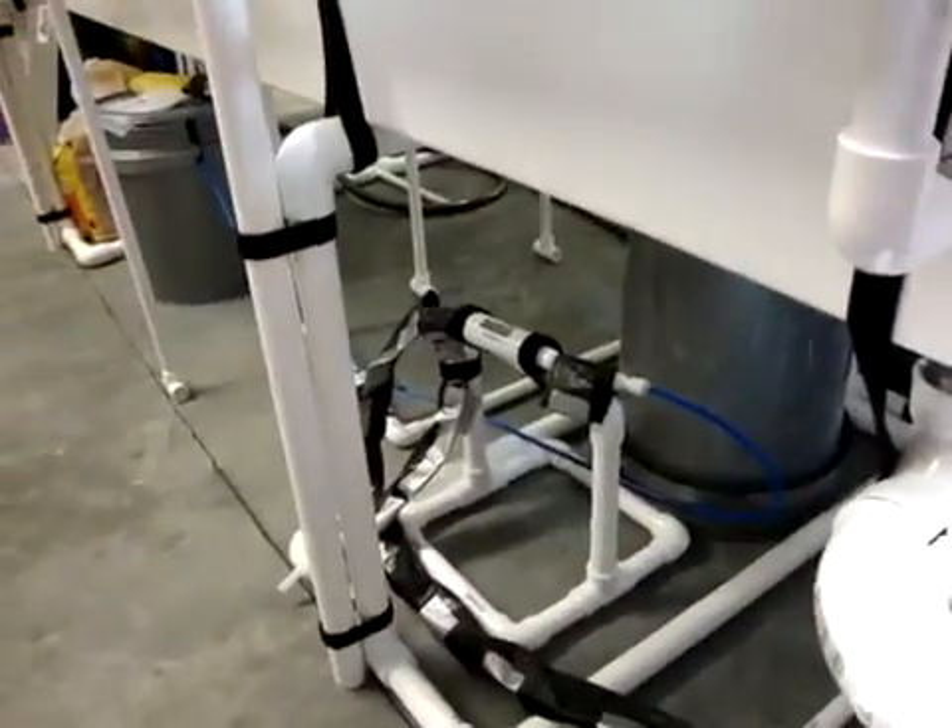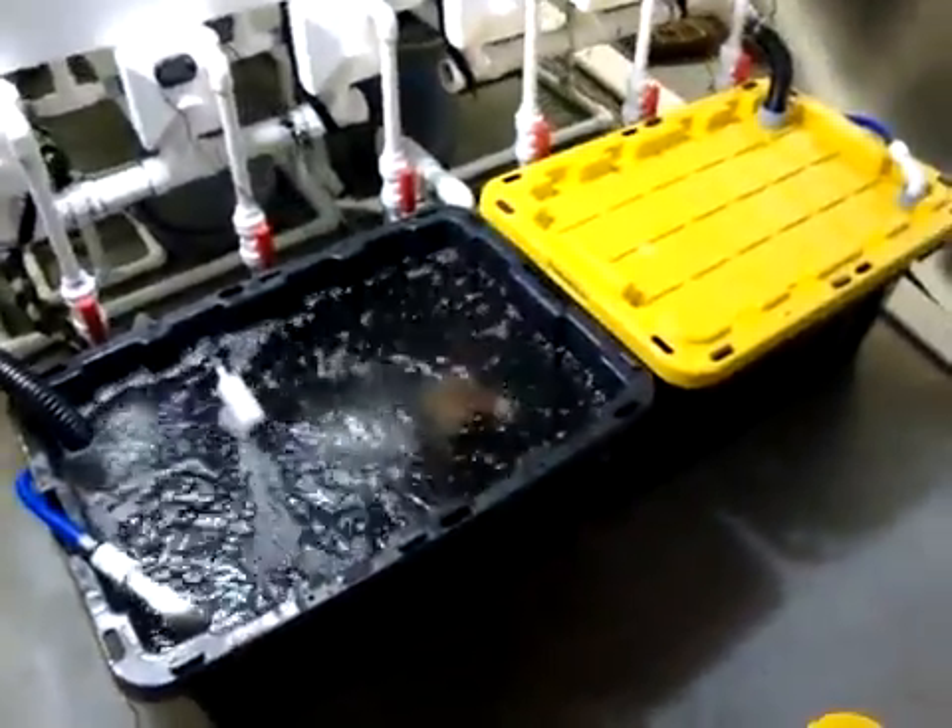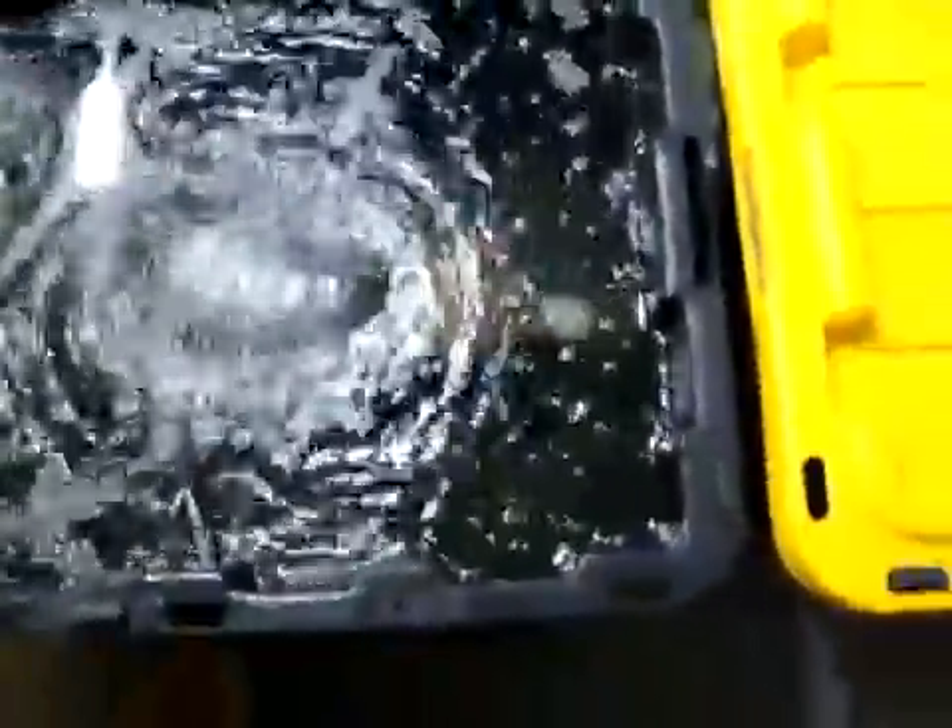I have one uncovered and one covered just to show you the two. The two are connected together at the pump — down there is a one-inch T-fitting. They connect both reservoirs together so they work dependently with each other. Down inside there you can see a one-inch electrical conduit fitting, the gray fitting. There is an O-ring on this side; this is the female, and the male is connected down at the T-fitting. The O-ring is on the inside of the reservoir container and that's just hand-tightened.